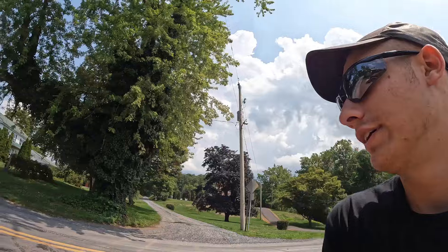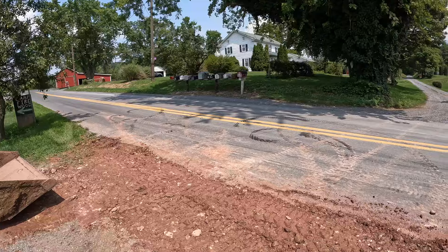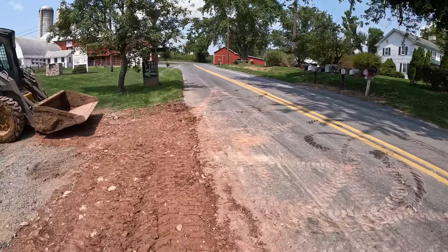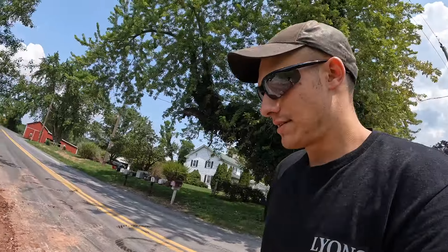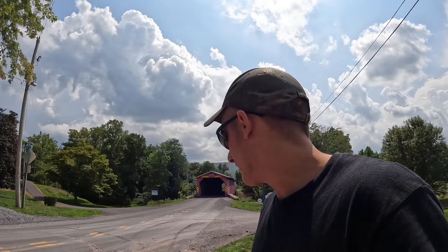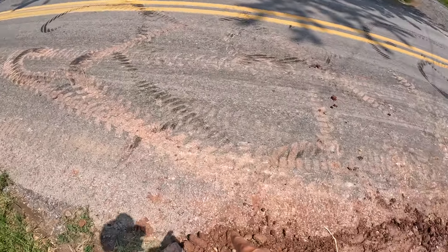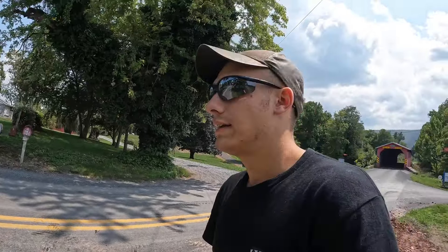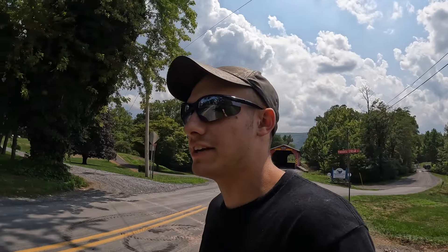Well I got all the holes filled in here. You can see you got a kind of a breaker there and then it's all above the real road a little bit. I'll pack this some more, it's pretty tight now but I'm gonna keep packing it and then I'll get some limestone dumped over top and then the water should just run right down by. I did this before up there and it worked, so I hope it works down here.